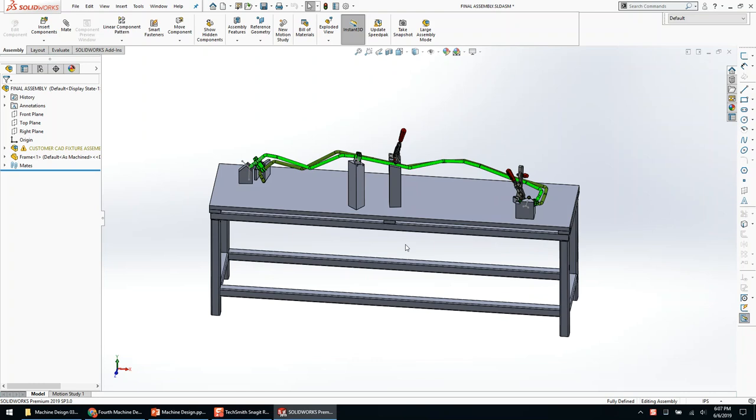Regarding sketch relations — I've been told to minimize sketch relations. Send them my way. Sketch relations have no issues causing slowdowns as models get larger. I would put a number to it, but I'd say an order of magnitude faster than dimensions. Do you go as far as putting fillets and chamfers in sketch relations? No.